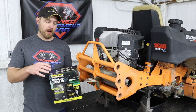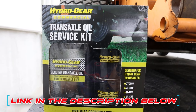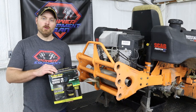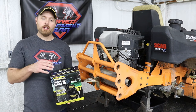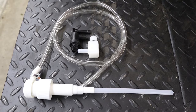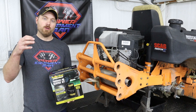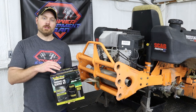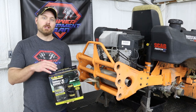To do this service, I recommend using HydraGear's service kit. They have one kit that comes with everything you need to complete this service. It comes with two oil filters and five quarts of oil. There's also going to be a pump and a couple of fittings included in this kit — those are to be used if your hydrostats don't have an external oil reservoir, so you have to pump the oil back in through the air bleeder bolts.